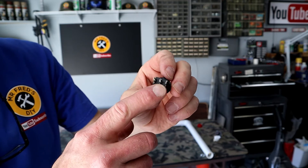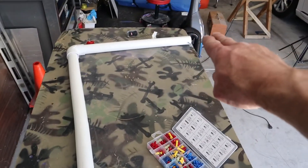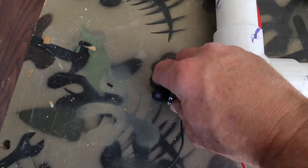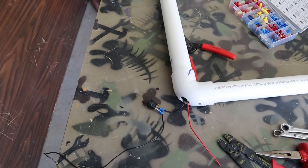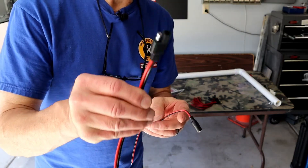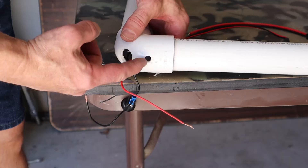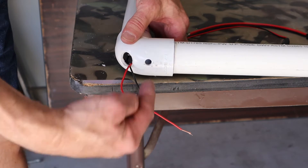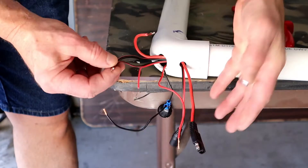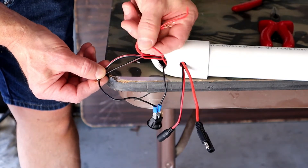Now I'll wire my switch. On the switch you can see there's a brass terminal and two silver terminals — we're not going to be using the brass terminal as it powers the LED light. We have one wire going to one eye bolt and another wire coming from the other eye bolt, and I've installed my switch to break the circuit in between. Next I'll install my two different pigtails for my two separate power sources: my SAE connector for the battery and the other pigtail for my AC power supply. I drilled a 3/8 inch hole in the elbow for the pigtails to hang out. The two black wires from our pigtails connect to the switch and all of the reds go together.